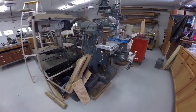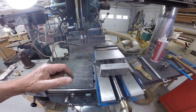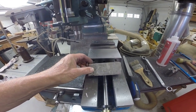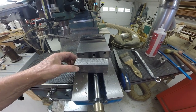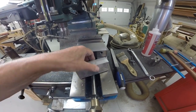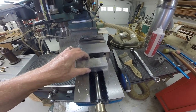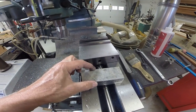And then the other end of the block needs to clamp around a 1-inch diameter frame member of the stroller. So we're going to start with this piece of aluminum. I just cut this from a drop. This is 1¼ inches thick. It's plate aluminum, 1¼ inches thick, and I cut a piece about 1¾ inches. I'm going to finish it to 1½ inches in this dimension.